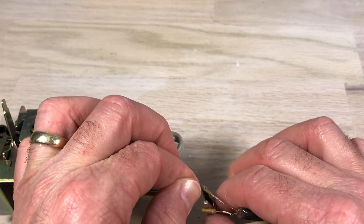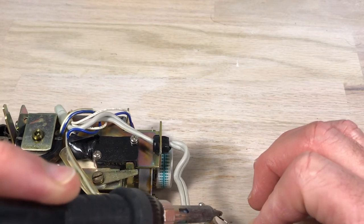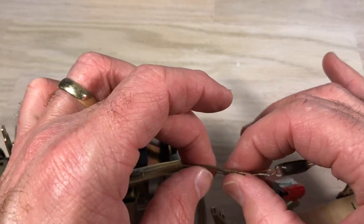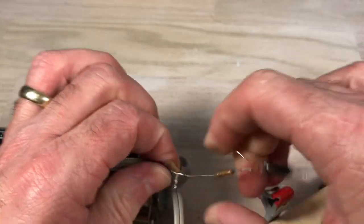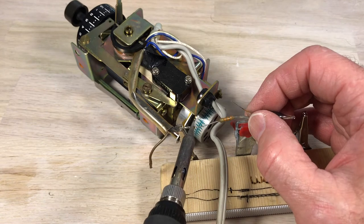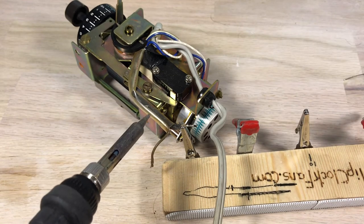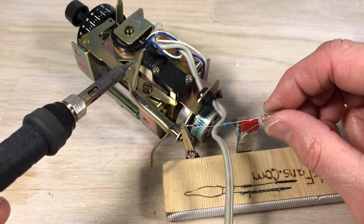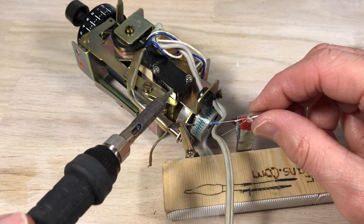I'm checking my measures and going to trim it up a little bit on the resistor side. Now I'm going to go ahead and desolder this bulb out of there — just apply a little heat, pulling with my right hand, and that came right out. Then we'll get things set up to do the resistor side. It's a little tight — I'm having to push back this tube that's covering it. It's a fiberglass-impregnated tube. Once I get it kind of secured, I pull it out. Curiously, it seemed like it left a hole inside there — they wrapped that wire around and then soldered it. I'm wondering if I might be able to stick it back in that hole. I've actually tried that on other clocks and never been able to do it, but you can see a little hole — add some heat, and it went right in. That probably will never happen again.